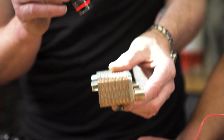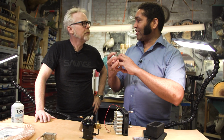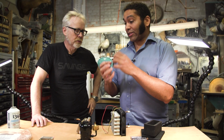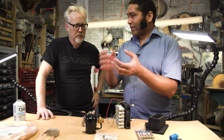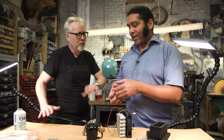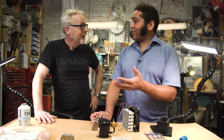It's actually not. It's a British straight pipe thread. And the reason British straight pipe threads are used for these is instead of a tapered American NPT. The taper thread is basically a compression, stretching, friction fit. So you're literally stretching the metal as you tighten that down. And that's great, except once you've got that preload, you have to maintain the preload or else the fitting fails. And if you're heating and cooling and heating and cooling, doing this thermal cycling, which by definition puts a lot of movement into the system, it's going to work itself loose. And no matter how much thread lock you put in that, eventually it will work itself loose.